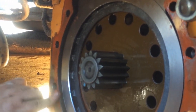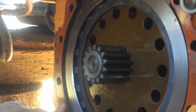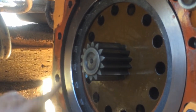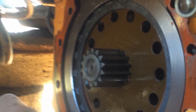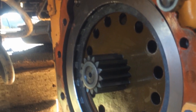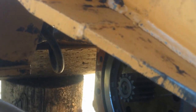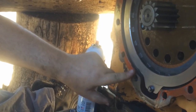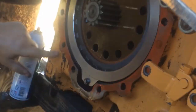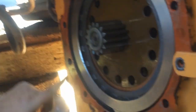Applying some silicone sealant to the transaxle housing prior to installing the axle housing. Good touch, it's clearance there. Tolerances. Got a bunch of oil on the bottom there, it looks like. Yeah, that's what I'm coming down to. Then I'm going to wipe that up real quick before I apply my last little bit in there.